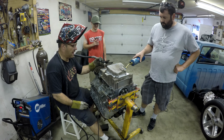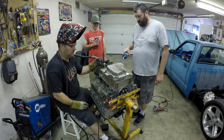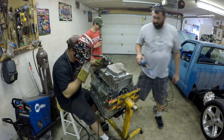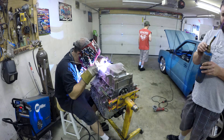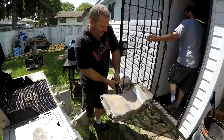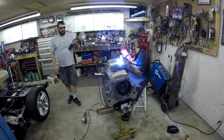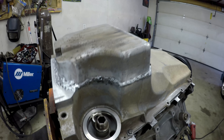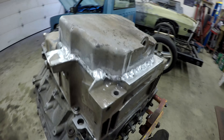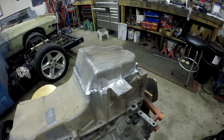I don't know if it's because I ran a pretty long bead — maybe I just have to keep going around with small tacks. When it was welding it was going really nice, so I figured I'd keep going. We put it on the barbecue again, got her super hot. I've just finished welding her up and this one actually went pretty good — it only cracked once or twice. Clayton was definitely helping out with the heating, and yeah, there you have it.